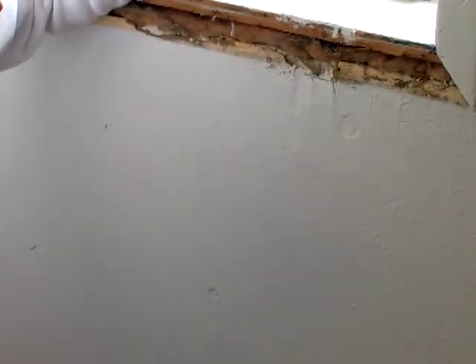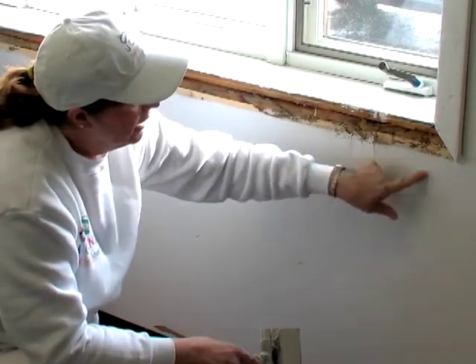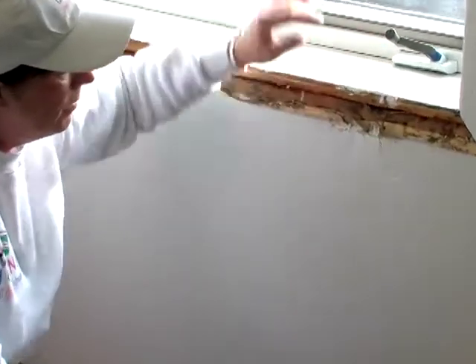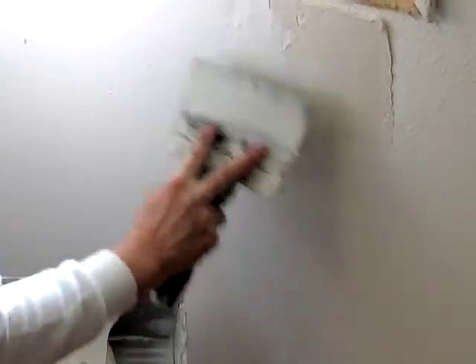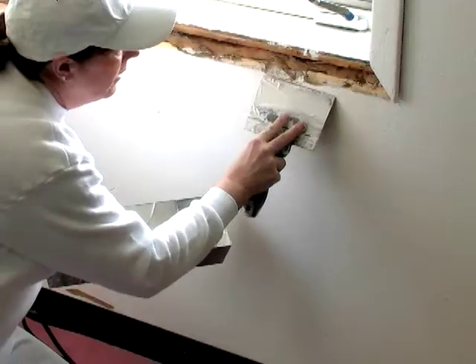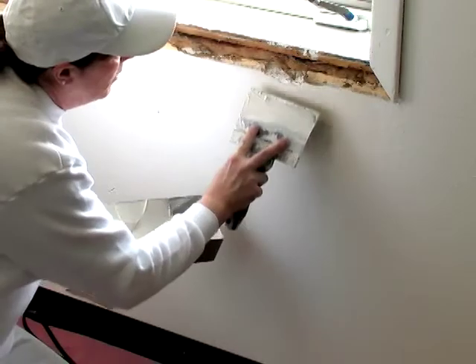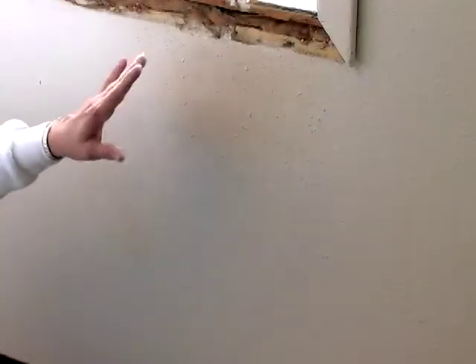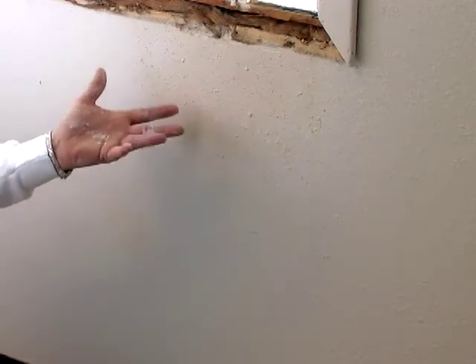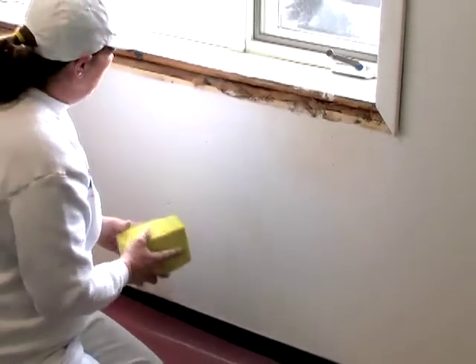You may come across in your home that someone tried to patch, put it on there, painted over it, and left a ridge — and no texture was put back on there. So we're going to scrape away anything loose. We've already filled our edge from the first one, so we're just going to get this spot that was the worst — it needs a little bit more. Prime this spot with a latex interior primer and then your color coat of paint, of course. And then that is ready to go.